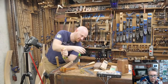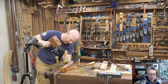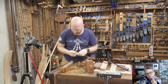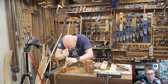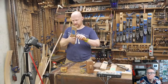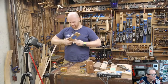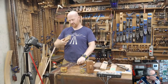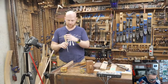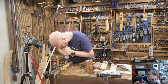Let me just make sure and double check — make sure it's not just riding on something on the side. There's a little bit of junk on the side. This is one of those things you just have to work at: put the tools in there and make sure they touch both edges. I just had a little bit of junk sticking out on the side that the chisel was catching on. Now we have a good joint that goes all the way across.